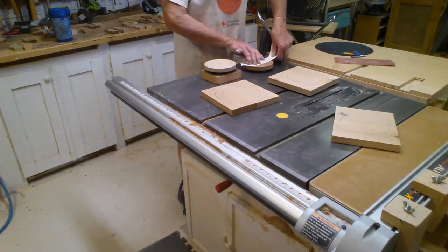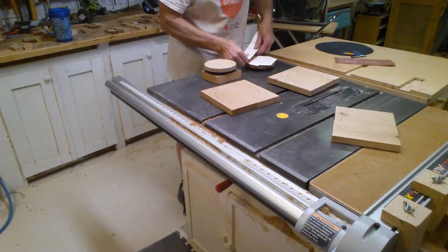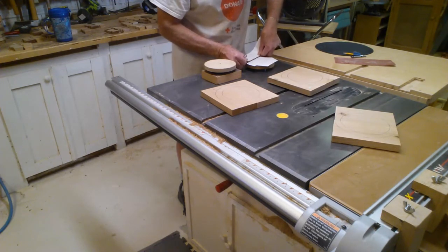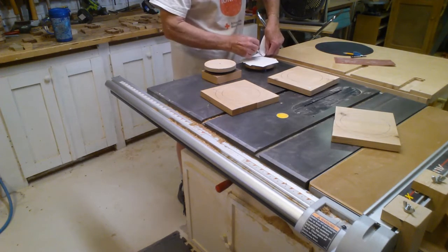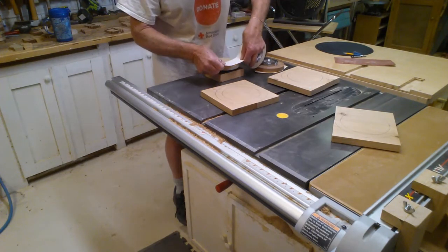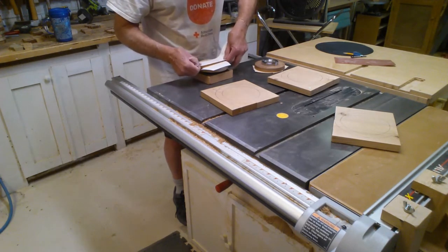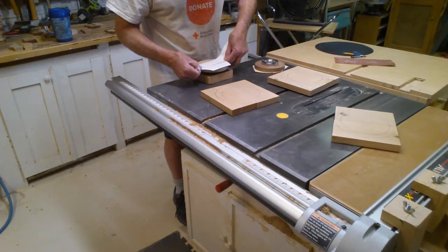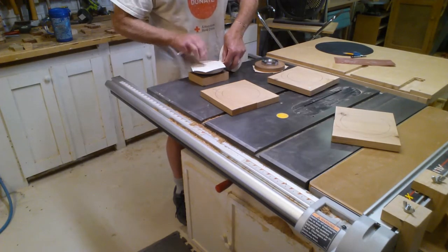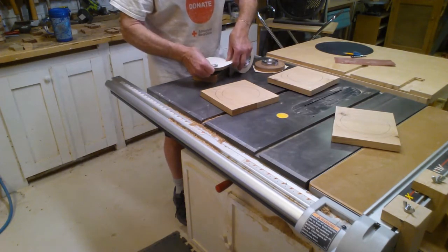I made a five-and-a-half-inch circle where my face plate is going to go. I put some double-stick tape on — I got this tape from Ken Wallston from the other club, the sawzall club. I just press it on a little bit by hand and slice off any excess. This is going to go on my five-and-a-half-inch circle and will be centered to my seven-and-a-half-inch outside edge, which I will cut off. I've got a Nova chuck ring and a regular face plate — I usually do two bowls at a time.